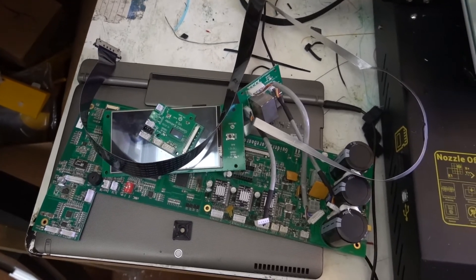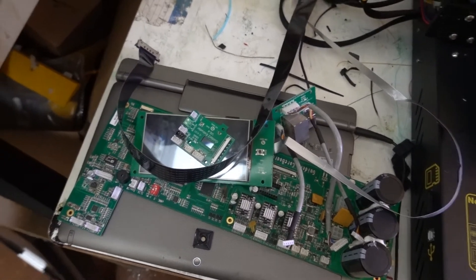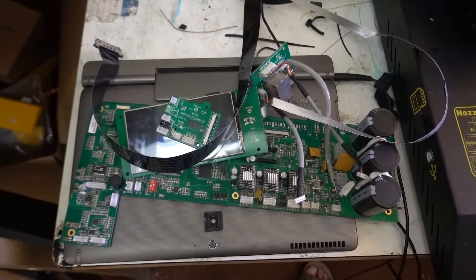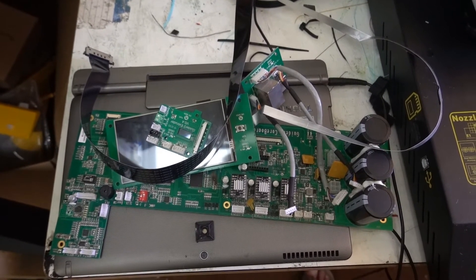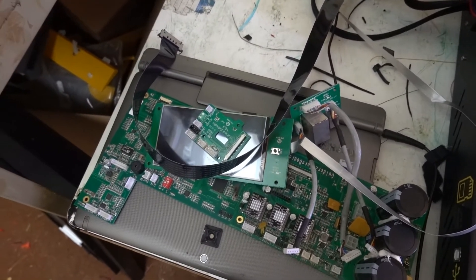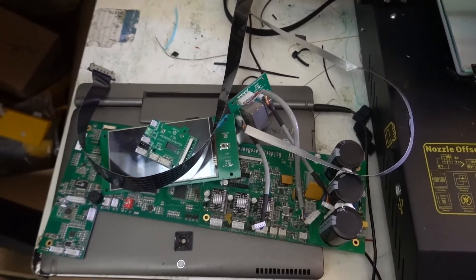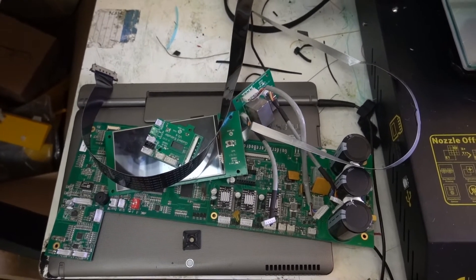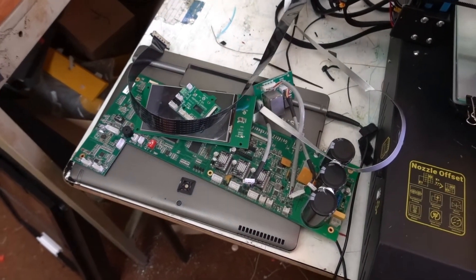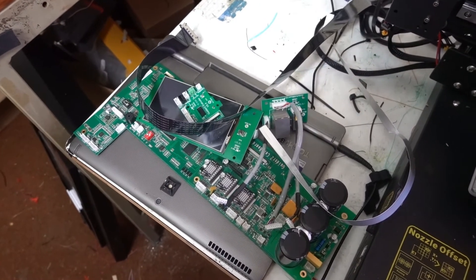This is a particularly noisy printer. I took the first stepper driver out, upgraded it to a 2209 — bang, magic smoke came out. I realized that the FlashForge stepper drivers are wired upside down; the bottom's facing upwards and the top's facing downwards. So I went on the FlashForge website to see what a new board would cost me, and it must be made out of pure unadulterated unobtainium or something like that, because it cost an absolute fortune. So I decided to replace it with a cheap 32-bit board.